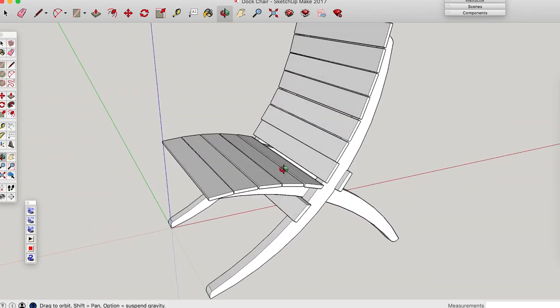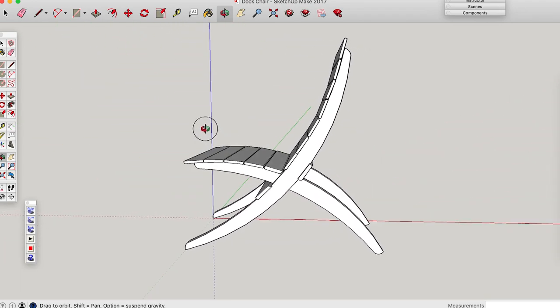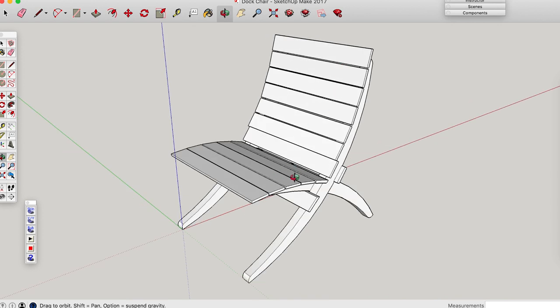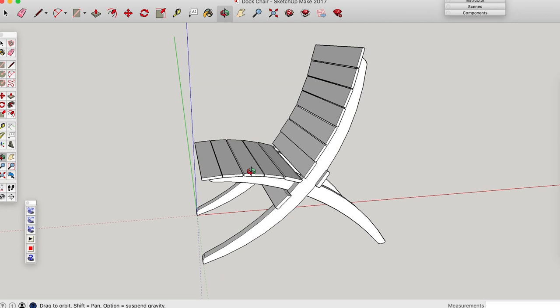Here's the model I mocked up. It's certainly a lot more delicate looking than some of the stuff you find online, like some of the Wood Magazine or Woodshop plans. The slats are spaced closer together — there's only about an eighth of an inch gap for drainage. I'm going to make the slats from hardwood, specifically teak, only three-eighths of an inch thick, which really changes the overall look. I'm going to paint the curved leg parts, so I can use two-by construction lumber, which will already be one and a half inches thick.